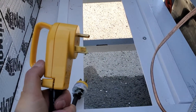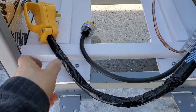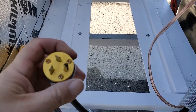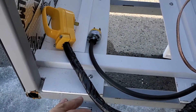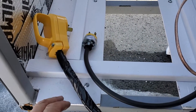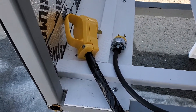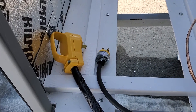This is a 30-amp plug, which is going to be the main source of electricity from the generator going into the breaker box. I've also run a secondary 20-amp one that doesn't add to the total capacity of the generator, but I could think of situations where — for example, I've got this plugged into an extension cord going into shore power — this could still be plugged into the generator for additional power, say, for an air conditioner.